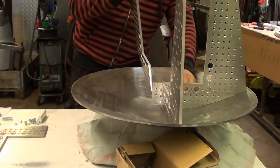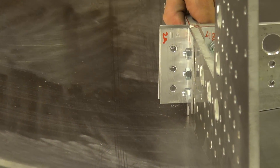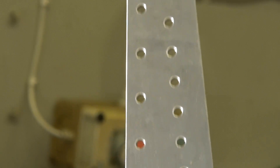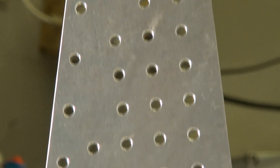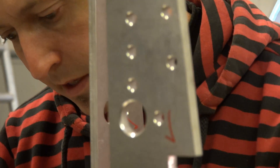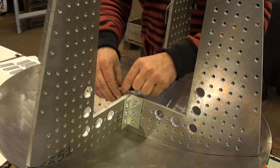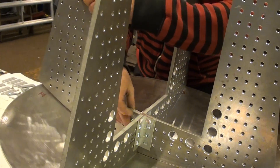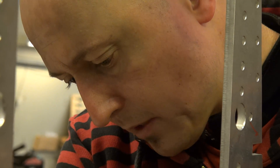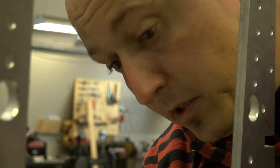The entire capsule is made from aluminum, and the final capsule for the astronaut is also going to be aluminum, so to get the best data on re-entry heating and other systems we are creating this model in aluminum as well. One of the big challenges is actually to make this model heavy enough. If you want to have the correct simulation of the re-entry through the atmosphere, we need to have the same ballistic coefficient as the final capsule. A bit of calculation tells you that this model needs to have a mass of almost 80 kilograms, which is very heavy, especially when made from aluminum.